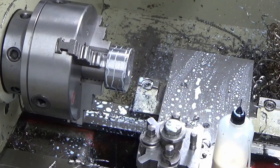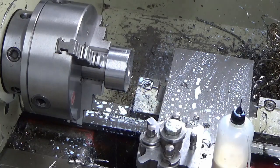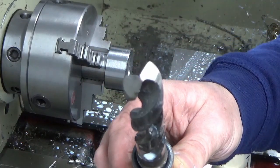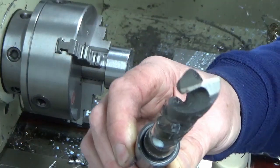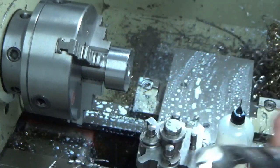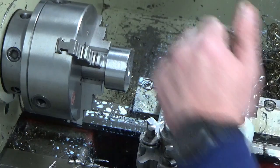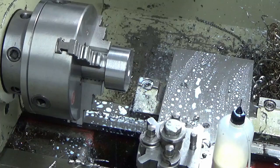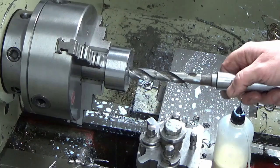This is horrible. I'm just going to tickle that drill up. Despite all the protesting and squealing, it's not really done anything to that other than dulled the edge slightly. I'll just go and tickle it up a bit. But I think this is work hardening.